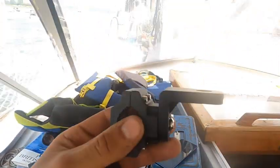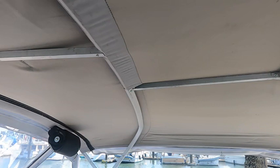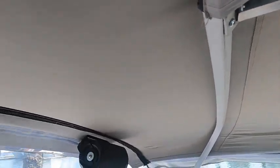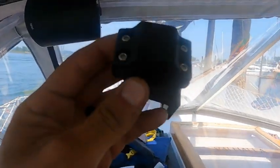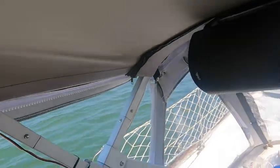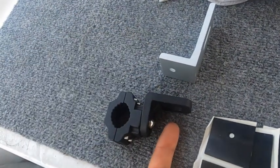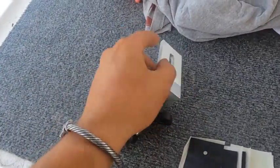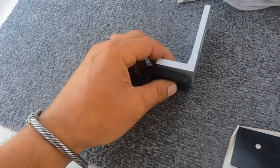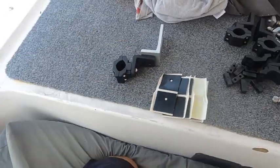And then we have these — I'm really wishful that they're going to do well. Our oddity is we're going to go to these rails, and they kind of look like a diamond shape the way they're positioned. Most rails are stainless round tubing, which would be much easier. But these ones have teeth — they're toothed so they should lock on. These are flagpole rail mount flagpole mounts. The plan is to put these under the Bimini, drill a hole on the bottom side, and sandwich these on top — so instead of a big slit through all the canvas we're just going to have that one hole. I'll also seal them with compound, glue them together, and hopefully we don't get any leaks.